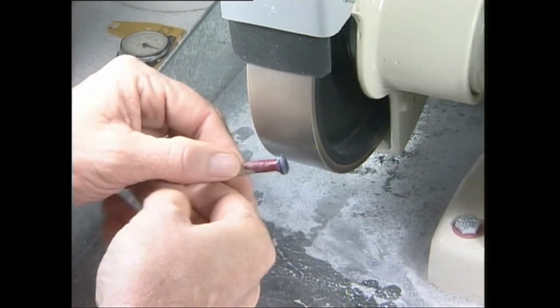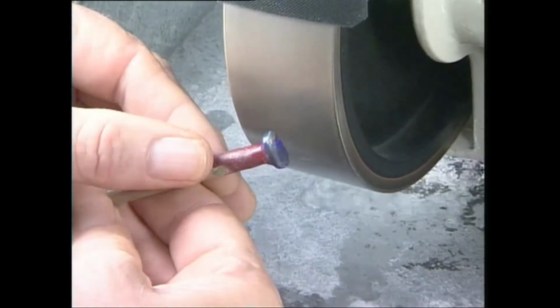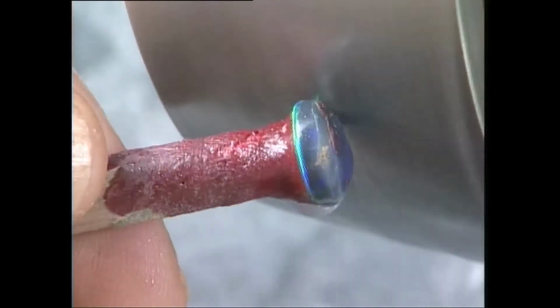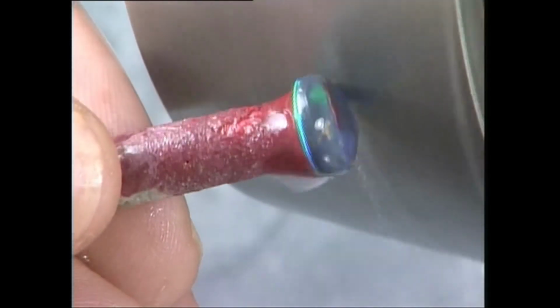And as with all the previous operations, I generally start on the highest point of the back. Get rid of the overburden and get a rough sense of balance before we go to a spinning technique. As we come to that sand, we'll slightly jump over that and not cut it. Not until we get down further with this edge. We're trying to get the edge as square and as straight as possible. We're working at an angle that we need to finish at. You'll see those angles a little later.